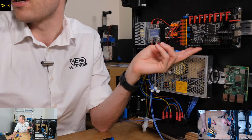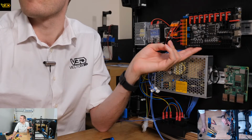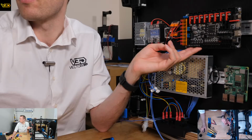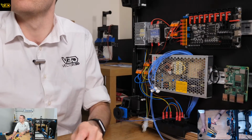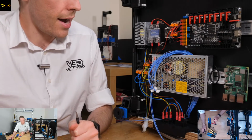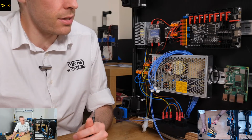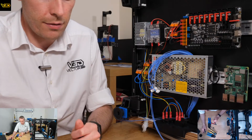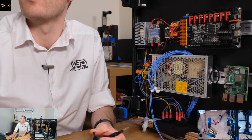USB-C cable should be good to charge up to 3 amps. The Raspberry Pi 4 is well under that. The way you're connecting it is one of the recommended methods from Big Tree and the Voron team. Interesting. I might have to do some current testing on the Pi at some point, because I swear I've seen specifications that say 3 to 4 amps for the Pi. And while this has a USB-C connector on the end, it doesn't necessarily mean it's capable of the full capability of the USB-C standard, I don't think. I don't know what the limiting factor is in the 500 milliamps, whether it was a computer factor or what. So lots of reasons why it could be different.